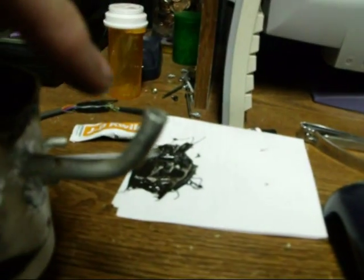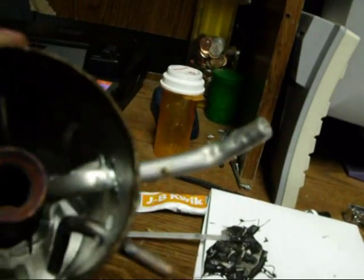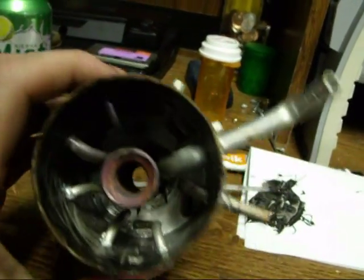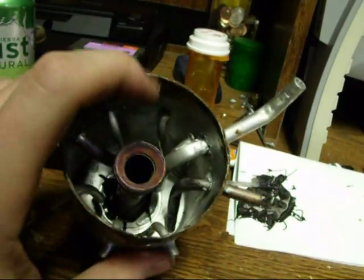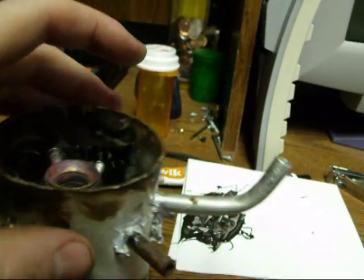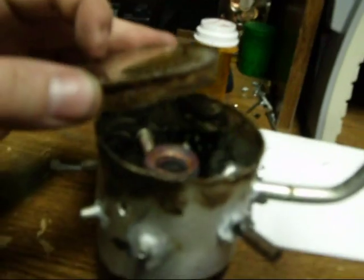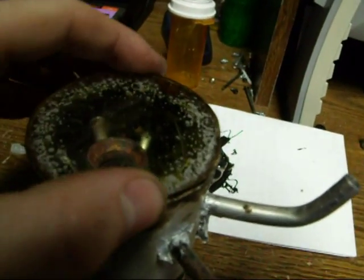This tube here is the fill tube. I actually had a kind of a bowl that attached to it, but I broke it last night when it fell off the workbench. And that's pretty much all there is to it — it's just a cup and then the fuel sits in the bottom and on the outside of the venturi, and it bubbles or percolates. And then I have a window that goes on top. So there's about a quarter to three-eighths of an inch between the top of the venturi and the bottom of the window.